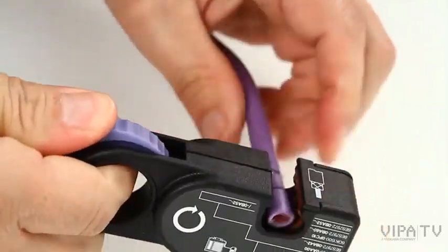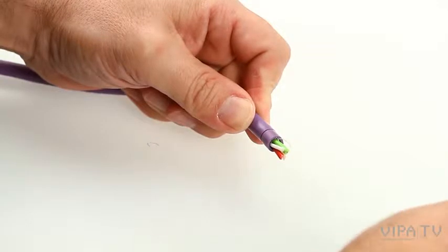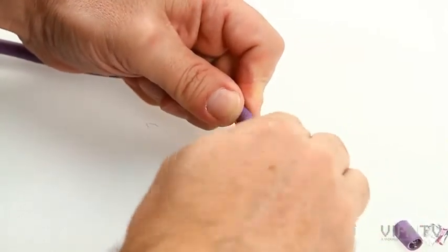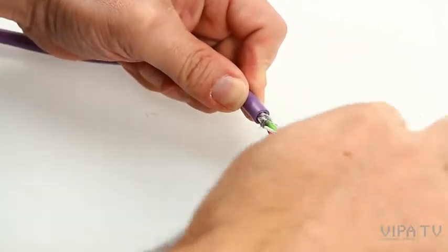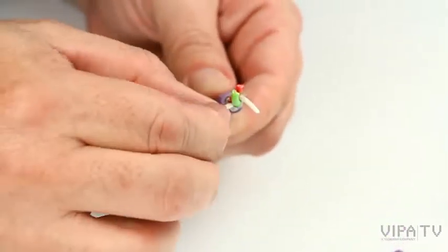After taking the cable out of the stripping tool, remove the insulator on the front together with the shield, and on the rear without the shield. If present, remove the strain reliefs with care, avoiding any damage to the red and green wires.